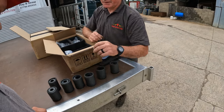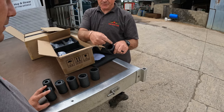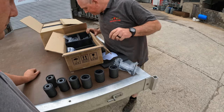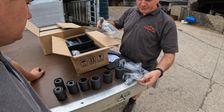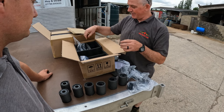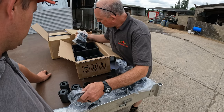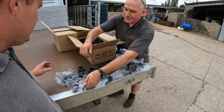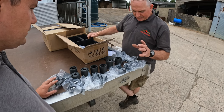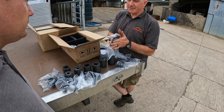We've got to figure out which one fits ours, and then that bolts into the center of the steering wheel in those bolt holes. There are also various brackets for various tractors to hold the electric motor from spinning - instead of spinning the motor, it wants to spin the steering wheel. Some clamp around the steering column and others just sit against the plastic work underneath the steering wheel.